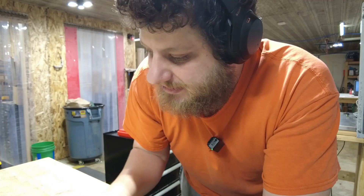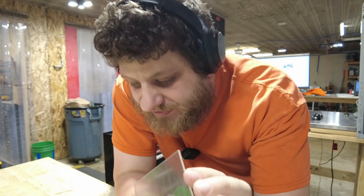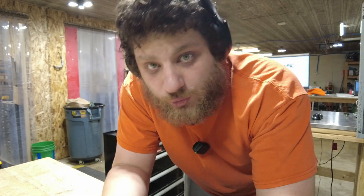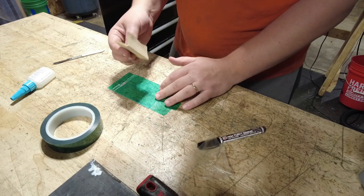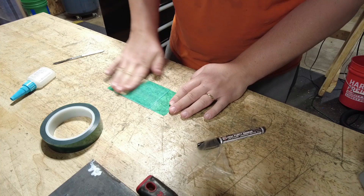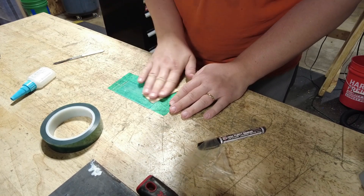Fortunately, because the surface was protected by the factory film, I don't need to do any cleaning or scuffing before I apply the tape — I go straight tape to acrylic. The one thing is to be really careful not to leave any gaps, because glue will get through and you'll have no way to remove it since you can't use acetone. After applying the tape, I scuff it up a little bit with 400-grit sandpaper — Scotchbrite works too but the sandpaper is a little faster.